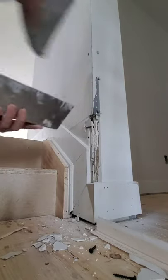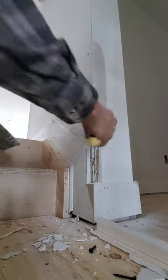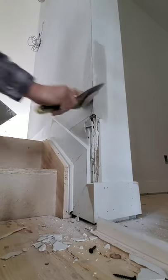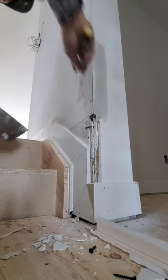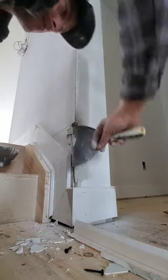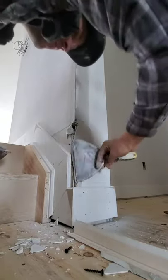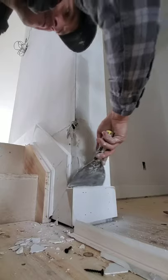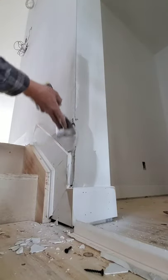Keep that little piece here. Give it a little pre-coat up here where it's really bad for your next coat. Remember, you can do 3-4 coats, 10 coats if you want with sheetrock. But we like to keep it under 3 coats for sure. So we're going to want to fill this up. Let me get that right fill. You almost want to build yourself that corner that you want before you put this plastic beading on. You want to put that mud, you want to fill that right up. It's a little trickier here when it's trimming away. But you master things like this, and a wall is a piece of cake.